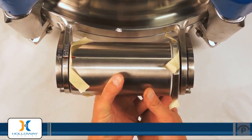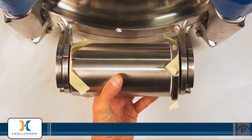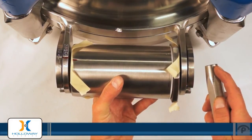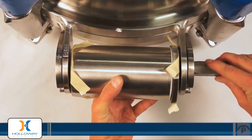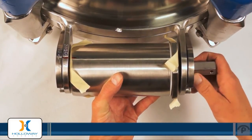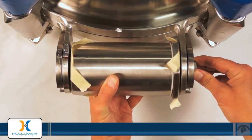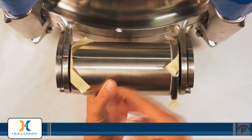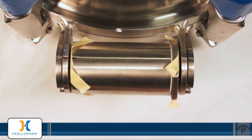We want to put the spring assist barrel between the hinges with our marks lined up. Use our hex bar with the tapered end to go in the right side hinge with one of the points of the hex pointing up. We'll push this hex pin all the way in, which will engage the inner hex pin into the left side hinge. Now your spring assist should hold itself in place.